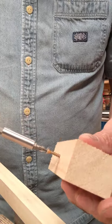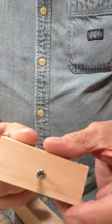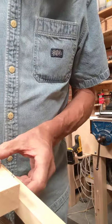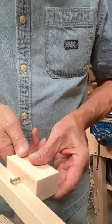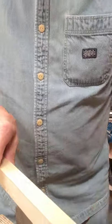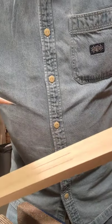A simple screw in a block of wood like this — and you can sharpen the edge of the rim of the screw if you want to — will give you an adjustable marking gauge that will work perfectly. See there? I've got a perfect line. Flip over and perfect. And I have a mortise hole in the middle of a piece of wood. It works so well.